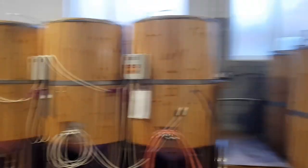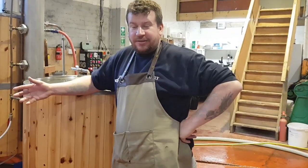You mean like what I've got? Yeah. They're more durable and more moddable, because you don't worry too much about cutting a hole in an old keg, whereas these things are paying three, four, five hundred pounds for a vessel. What thickness is the stainless steel? Kegs are almost bulletproof — I think a keg is around 1.6mm. This SS Brewtech stuff is only about 0.8mm, might even be less. It doesn't need to be that thick realistically; kegs are designed to take pressure up to 100 psi in a commercial setting with idiots throwing them off the back of a lorry. But nobody's trucking this stuff around.